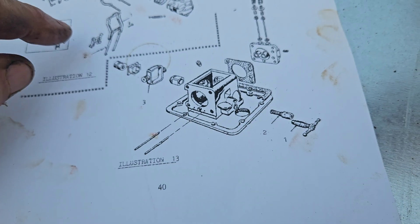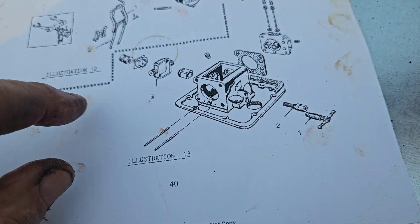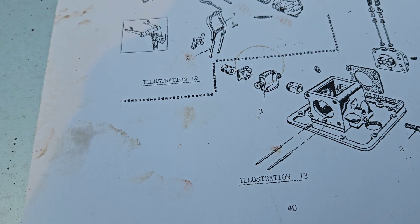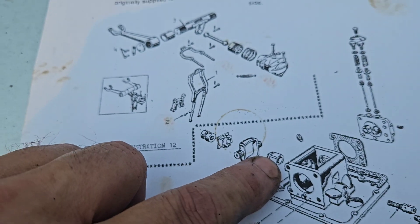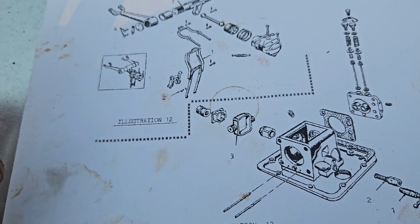This goes down on top of that — that's the spool. That's the relief valve; the relief valve is on top of the spool. These are weird pumps — they're boxes that run on cams. There's a small box that runs into a big box, and this is the piston plunger right there. Craziest pump you've ever seen.